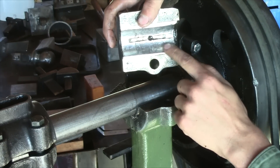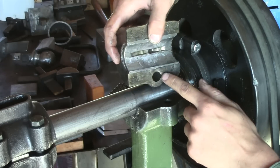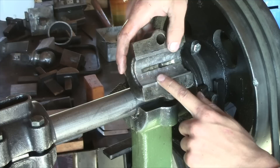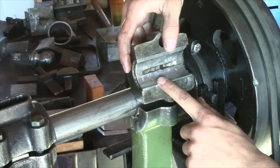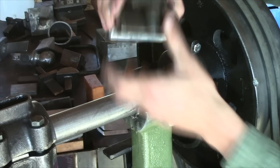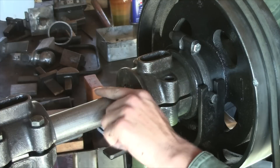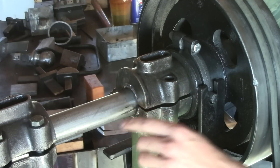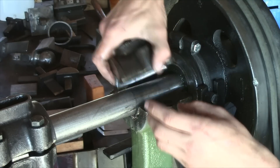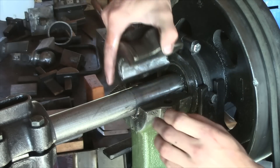This lighter silver material in the middle is our actual Babbitt material. Babbitt is made of around 80% to 85% tin, with the rest in even parts of antimony and copper. This bearing will sit on top of the shaft and make direct contact with the steel shaft. On the top there's an oil hole, and inside the bearing is a little grease groove for that oil to spread out over the shaft.